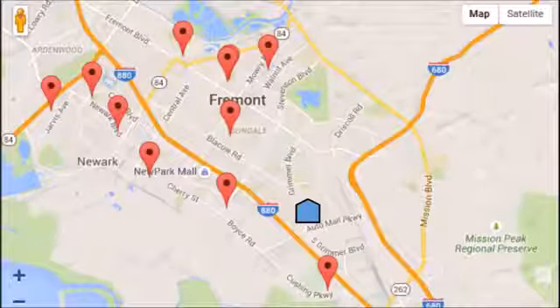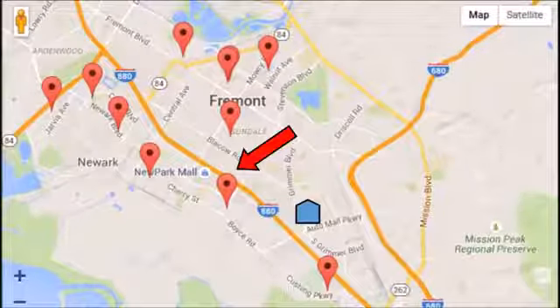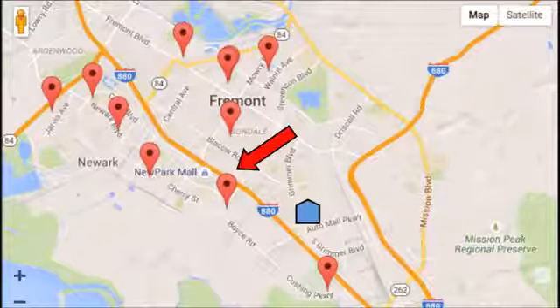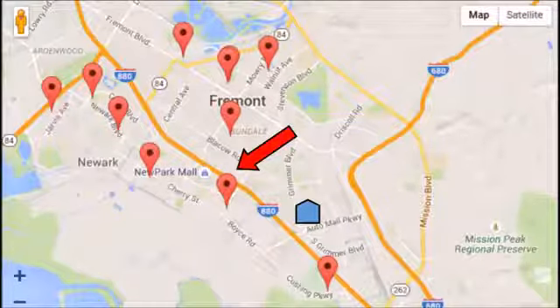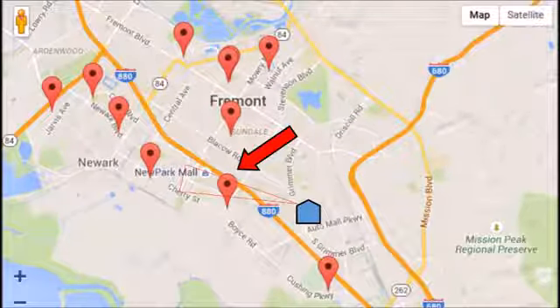Once you find out that information, you can decide which antenna is best for the outdoor donor antenna. Let's say your carrier's tower is quite close to the building or house — it's quite possible that there will be too much signal going into the booster, resulting in the red lights flashing, which signifies the booster is overpowering and will shut off. If you have a Yagi directional antenna, pointing that high gain antenna right toward the tower will overpower the system.